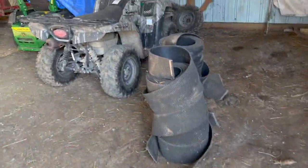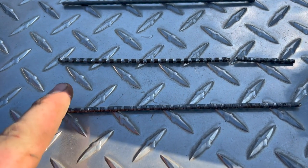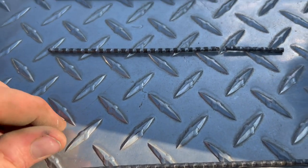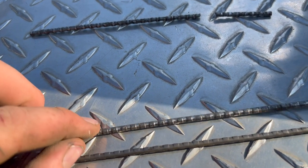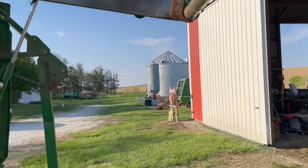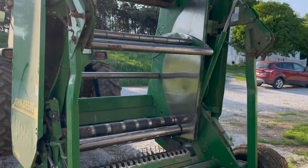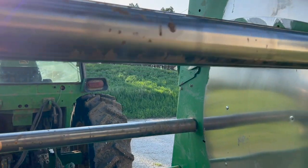Another reason I take the belts out is so I can look them over. I got all my belts laying over here — eight total, four longs and four shorts. It's nice to take a look and see how your splice is looking. I also always like to replace my pins. This is a pin that is not broke — one year old, you can tell it's got some good pull there. This pin was replaced, it was broke one year ago. And this is a brand new one. As cheap as these are, it's nice to just go ahead and replace them every year. I take my belts out just to get a good look over on the baler. We'll spin rollers around and make sure everything spins freely.